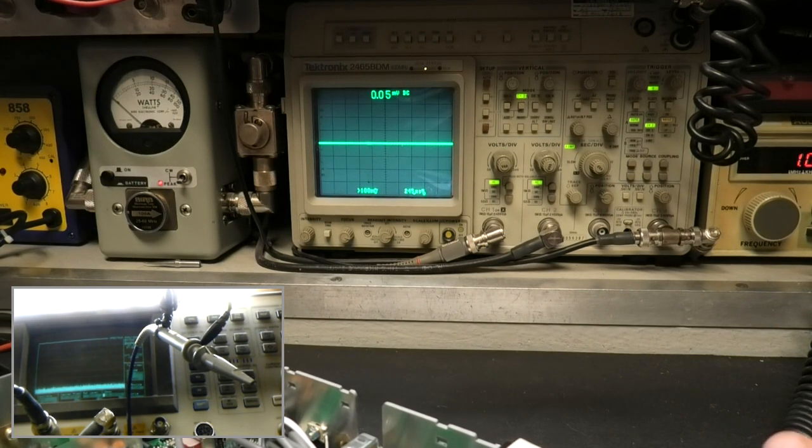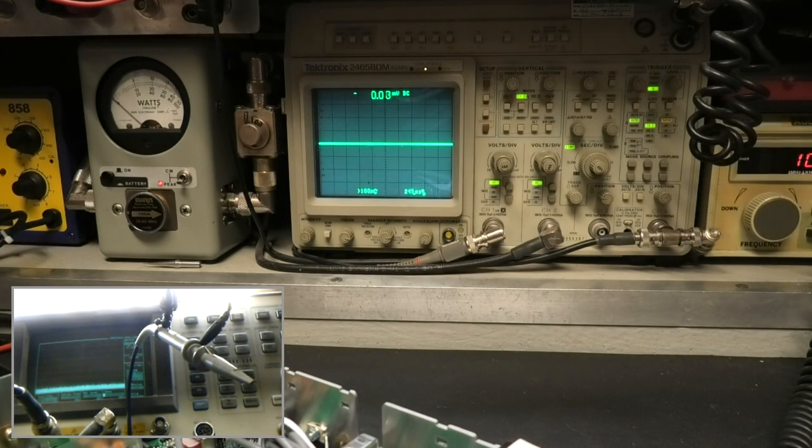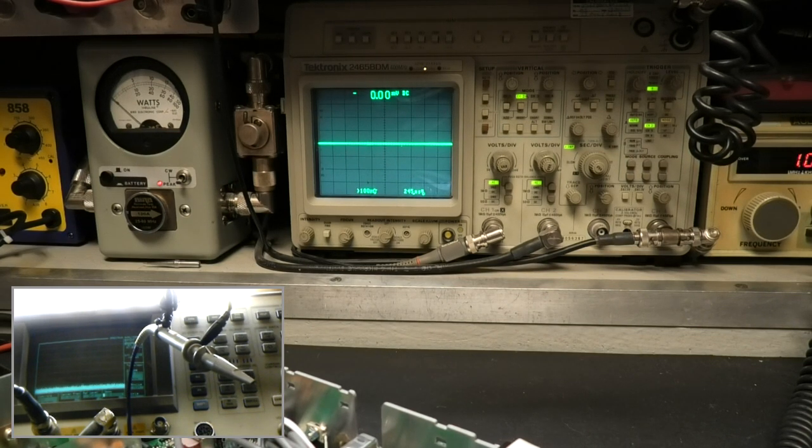You guys that are running the single final radios, bipolar transistor 2078, the 2166, by the way, that was always my secret weapon in the GTLs, whether it was a Dynascan, Cobra, Uniden, the Uniden 78, that's what they came back to. But if you look up the specs on a real Mitsubishi 2SC2166, I believe it's 13 dB gain. It's quite a bit for a transistor. And if you know what you're doing with the biasing with that, you could do a lot with a single. More power isn't always what you want. It's the gain of the transistor.